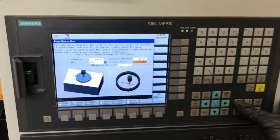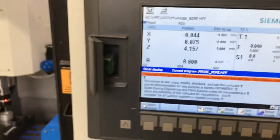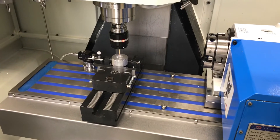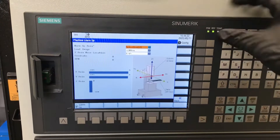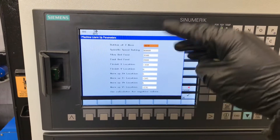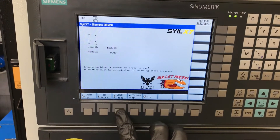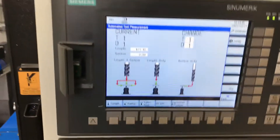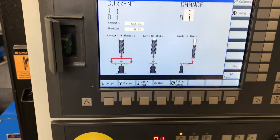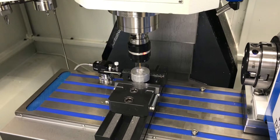That's it. How close were we when I roughly centered the probe? That's how far off I was — pretty darn good actually, that's surprising. That's how easy it is. I've been really enjoying these and obviously the warm-up is super cool. There's a config section so you can set all the parameters how you want. The tool probe has calibration, the work probe has calibration, and when you're measuring tools you can actually perform a tool change right here, which is really handy if you're going to measure a bunch of different tools.